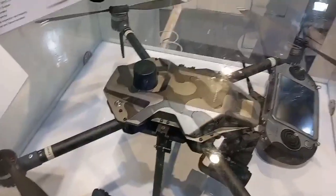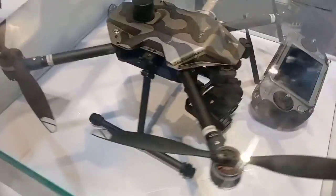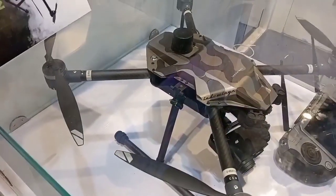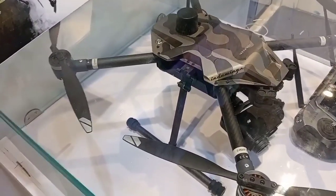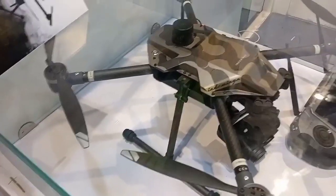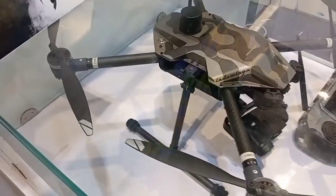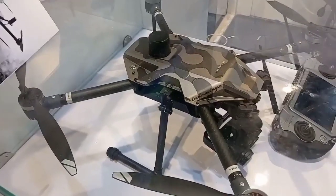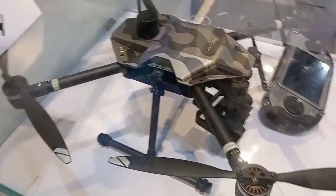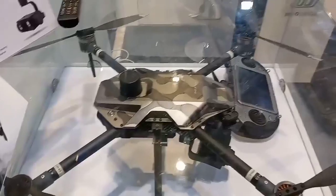The zooming capacity is around 10x zoom RGB plus 640 thermal, and the resolution is around 1080p. The sensor size is 1/3" CMOS, and the optical zoom is 10x. The focal length is around 4.9 mm to 49 mm. It supports the tracking function, and it supports uncooled radiometry and high speed thermal, and it is used for thermal inspection and mapping, surveillance and reconnaissance.